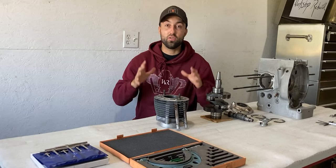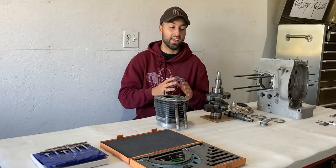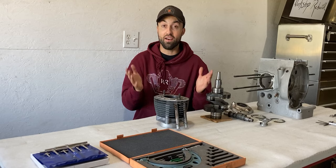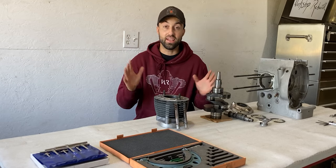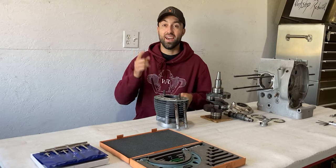If you'd like to know all the results I received throughout my measurements — since I didn't show everything on camera — you can click the spreadsheet link in the description below. In an upcoming video I'll share a full engine rebuild, though that will take a couple of days or even weeks. To summarize: this is a BMW R60/5 engine, around 600cc — but really the measuring techniques are the same for almost any engine. For the crankshaft use an outside micrometer; for internal measurements use a dial bore gauge or telescoping gauge. If you have any questions, drop a comment below, and if you enjoyed this video, please hit the like button.